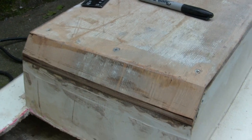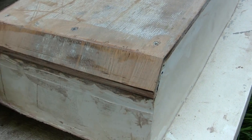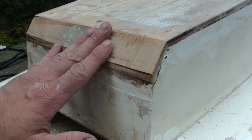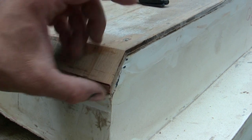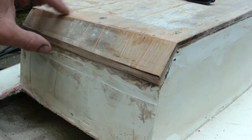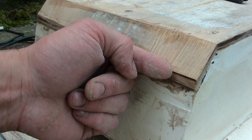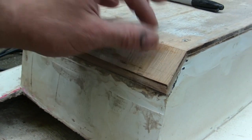So one change that I made was to the back plate that you have here. As you can see, I plated it over with a brand new strip of wood. This was to make the piece a bit cleaner. The thing is, if you add material here, this is going to extend the angle this way, and it's going to look a little bit wonky. By adding a plate here, one, it gives the hull a more appropriate look, and the second thing is it's easier to flare it in this type of a cut, and it'll look appropriate as opposed to the other way around.